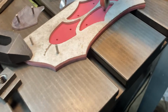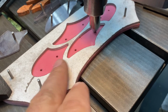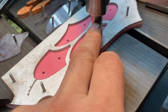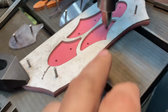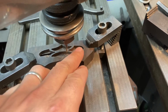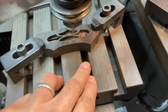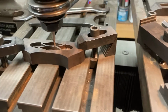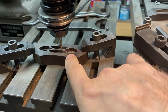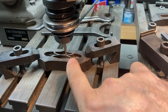And coming over the arm there, you can see that I used the actual pinhole locations for the pattern pieces with a tapered, pointed stylus, and I just push those down until it's snug and the stylus can't move, and then plunge cut my hole. And once I've got 2 holes under each one of these cavities, then if I get an inlay piece stuck in there, I can actually push it back through from the other side with a piece of 3/32 pin stock.